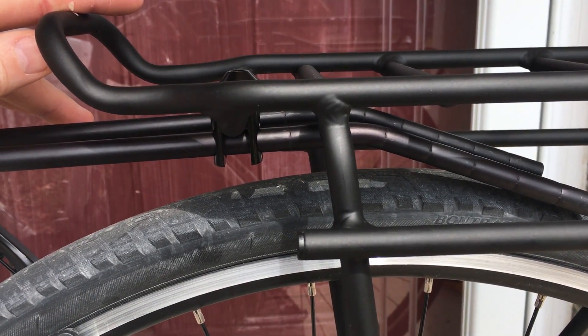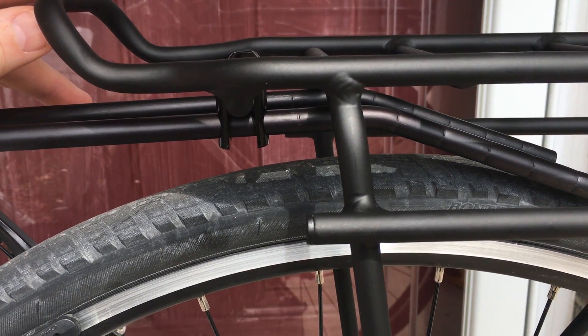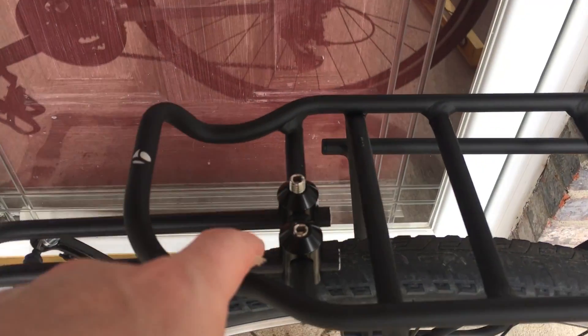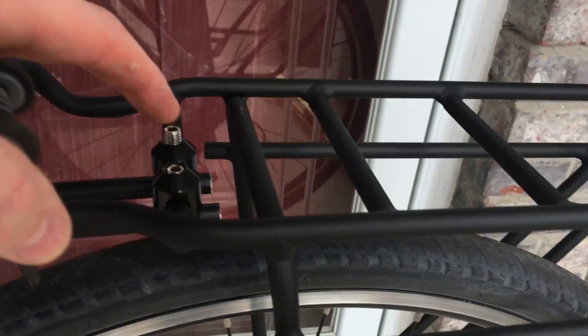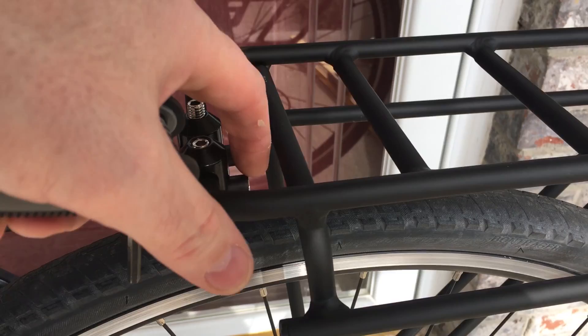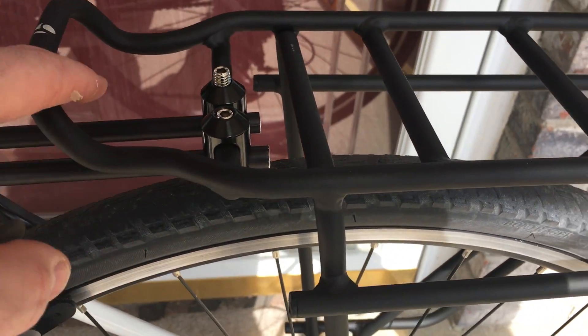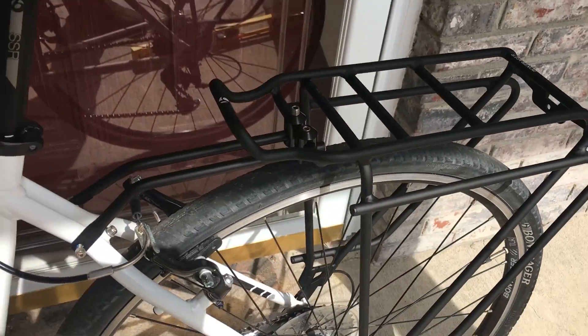After doing this it became apparent that the first cutoff line should work — that's about level. They have little rubber pieces to go on the ends to cap them off, so you need a little space for that, but right at that cutoff line should do it. Take them back off and cut them with a hacksaw. They cut rather easily because they are aluminum. These do need to be deburred with a file to clean them up a bit, then you get them on there, even them up, and get your leveling right with a level.